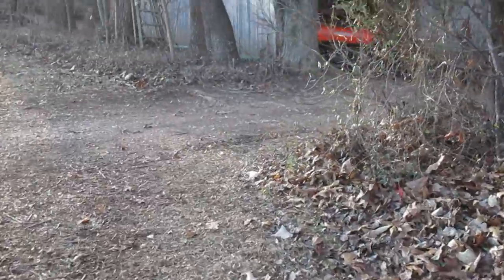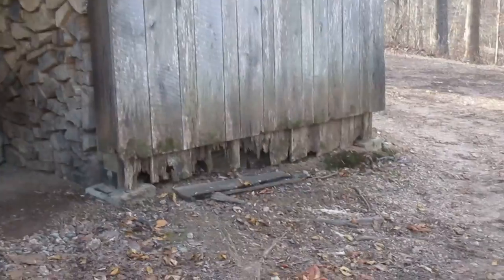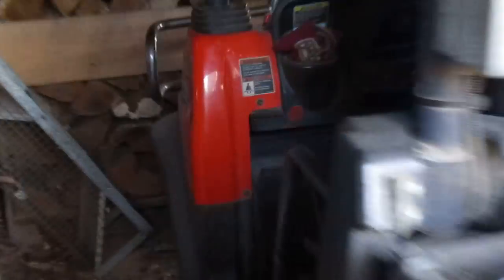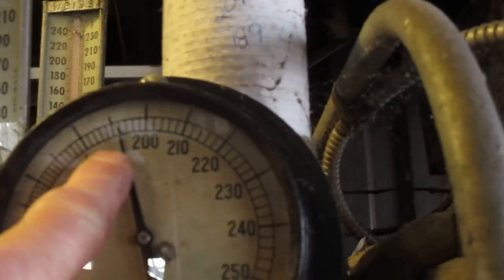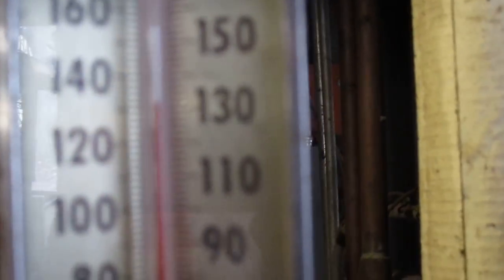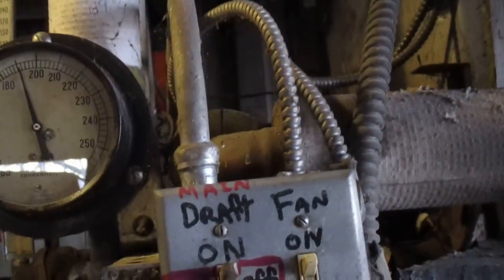I need to get a piece for one of my doors — it stopped working to get into the house — but we've got so many doors it doesn't make any difference. The house is calling for heat now through my little rat maze. You can hear that pump running, so the pump light over there would be on. We're down to 192 temperature, so the water going to the house is nice. We're at 132 on return. I'm going through three coils in the house — two 100,000 BTU coils to heat the house, and an 85,000 BTU coil that heats the upstairs garage.